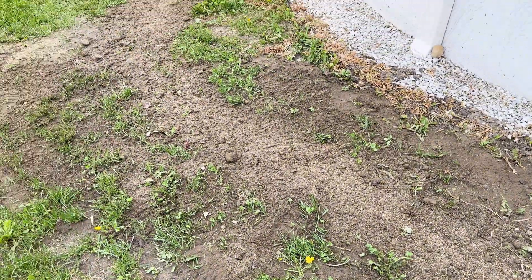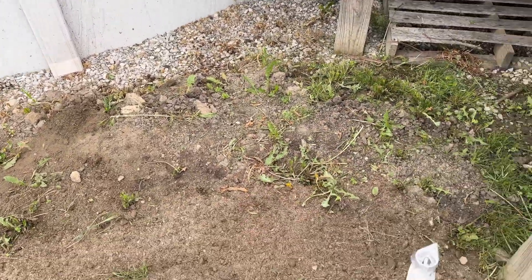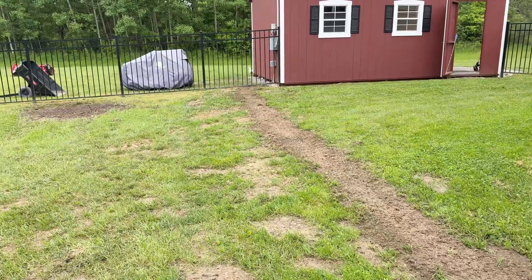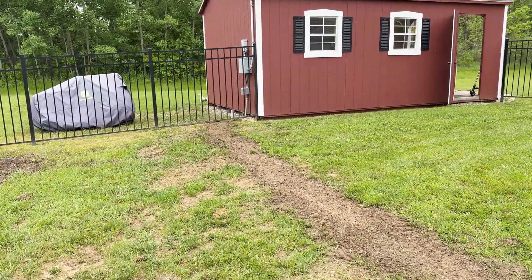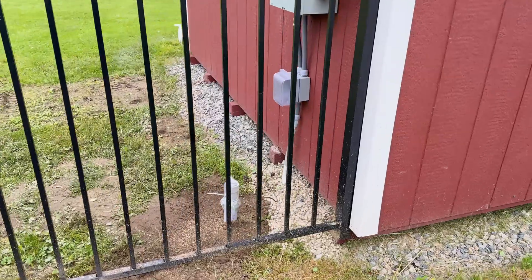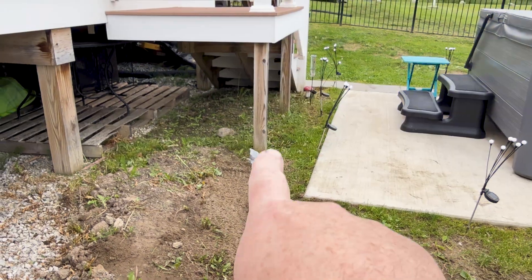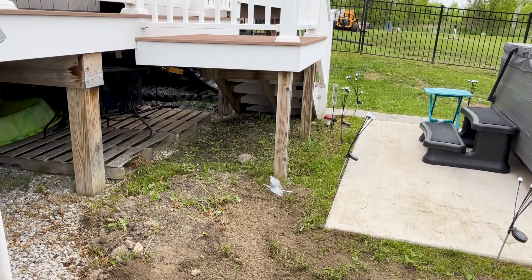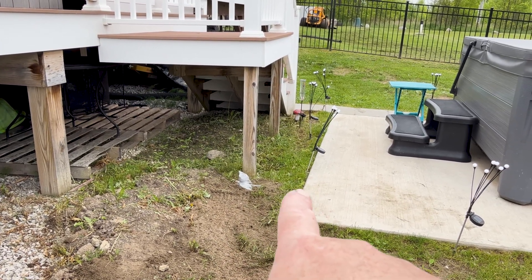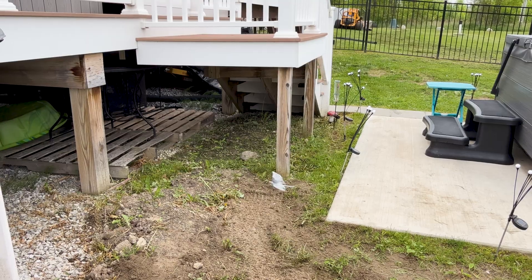I worked late last night on the trench and the conduit, and I got things filled in. Still want to take out some debris over here, but it's all buttoned up. It's supposed to be torrential rain today — hoping I can pull some wire before the rain starts, because then I can start wiring. The conduit came out okay but I had some challenges: I couldn't get any closer to the building because I hit the ground rod, so I'm going to have to 45 over to the 12x12x6 box. I got close to the poles, so I'll go up and then under the staircase where I have another 12x12x6 pull box. I didn't want to get any closer to the cement pad where the hot tub is because of gravel, so I thought that was the best place. I'm pleased with that one, but the other one I wish I had gotten closer to the building — it just wasn't possible.